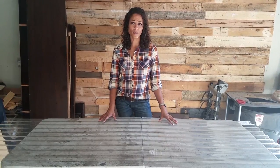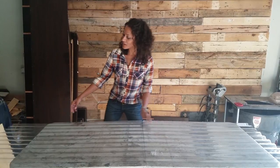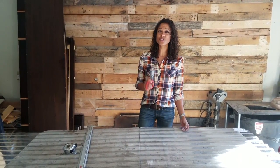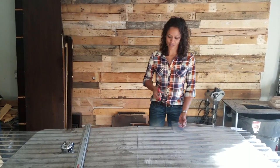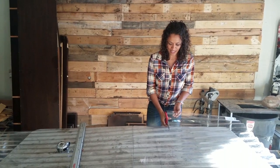I found this piece at Lowe's and I was quite impressed with how affordable it was. The panels come in 26 inches by eight feet long so I'm actually going to cut two pieces using my tin snips to get the length I want. For viewers who don't want to use tin snips, you can also use a utility knife or a circular saw with a plywood blade that's been reversed. For me, I'm using the tin snips and they work great — I'm able to cut through this pretty easily.